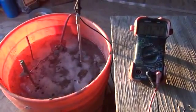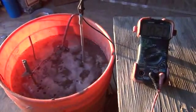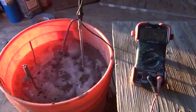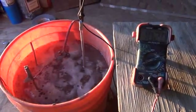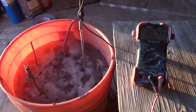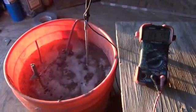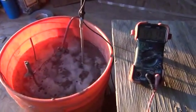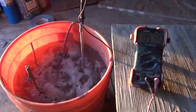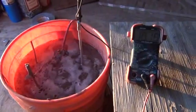Now let's say we needed 10 amps — that is 24,000 couples of these dissimilar conductors to produce 10 amps at 12 volts. It sounds like an awful lot, but these don't need to be very big around. At 2,400 couples for 1 amp running 24 hours a day, you're talking about 288 watts throughout a 24-hour period.